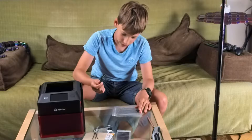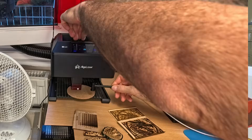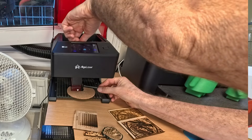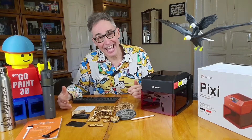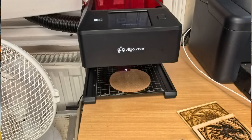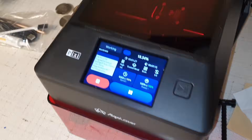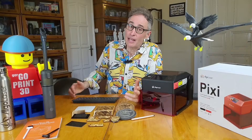There's a little tool in the box - it's the measuring tool for setting focus manually, used in combination with the thumb screw on the tool head. The motion system is capable of moving the tool head at speeds of 6000 millimeters per minute on paper, though as you'll see, line drawing accuracy diminishes over 3000 millimeters per minute.